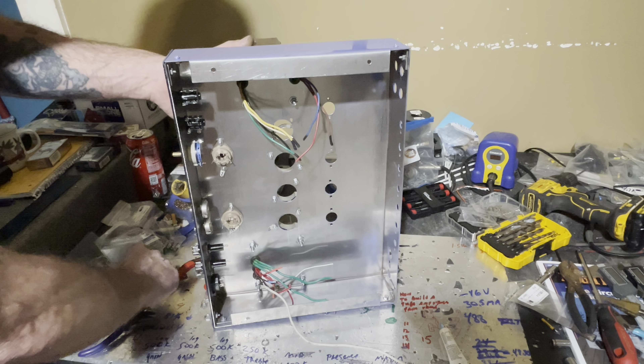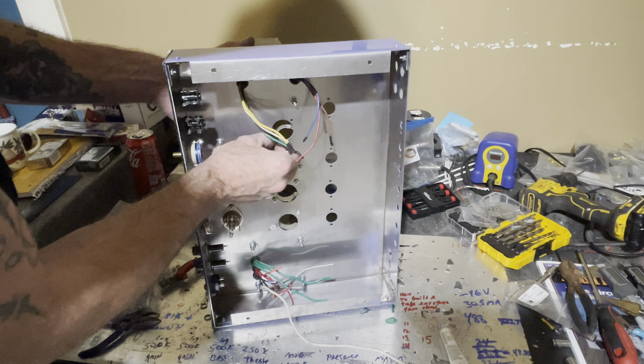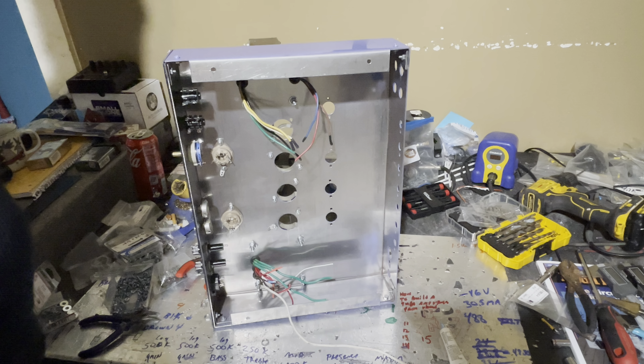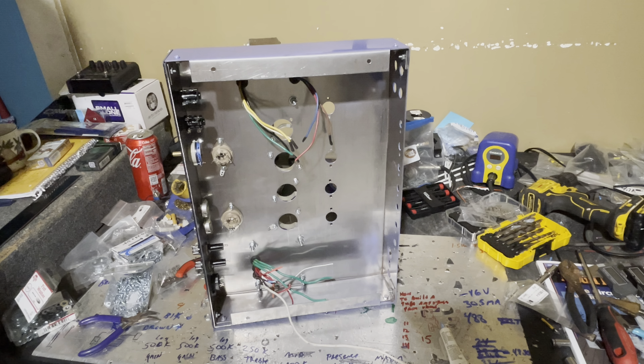A lot of problems that you have with amplifiers is ground hum when you build them. But if you lay out the grounding schemes properly, your amp will be the quietest amp that you ever had — it doesn't even matter if there's any gain in it or not. Hum is different than the 120-hertz frequency noise. We're going to take another one of these grounding lugs and bend it a little bit. The reason why I bend it is because if you just put it in there flat, it'll lay flat and then you'll have to bend it later and it's a pain in the ass.